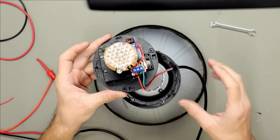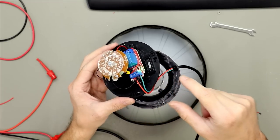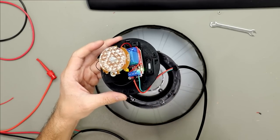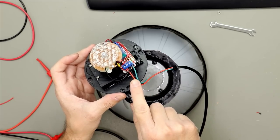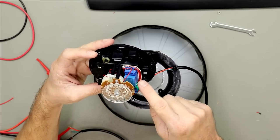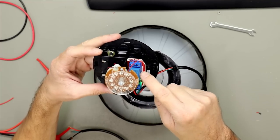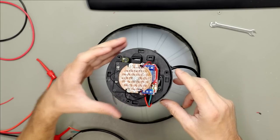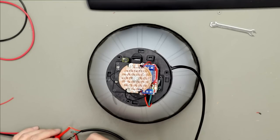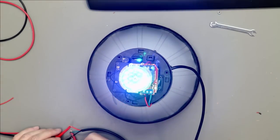Okay, so here's the bowl with the gutted inserts. And I installed this relay here, so I can trigger it with an output from the Arduino. You get the power from here, and it's the signal cable from the Arduino. And it's patched through here. When the relay gets on, it connects it to the power. Let's demonstrate that for you. Let's get 5 volts to the input. You can hear the relay triggering.